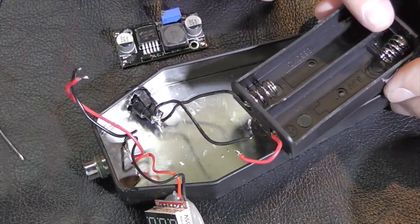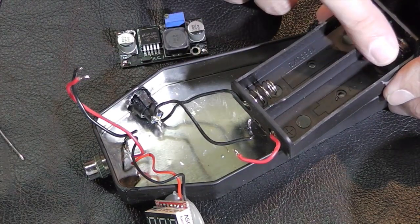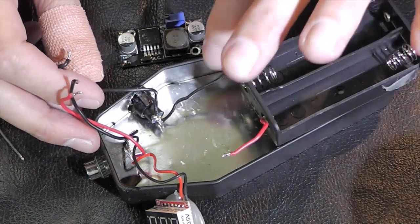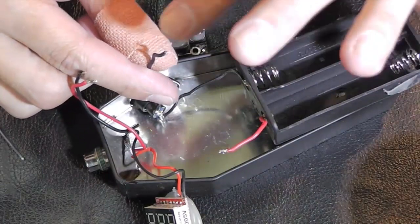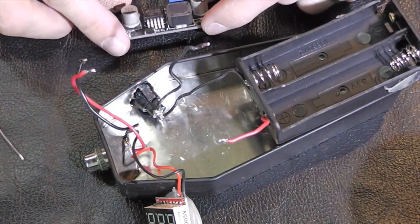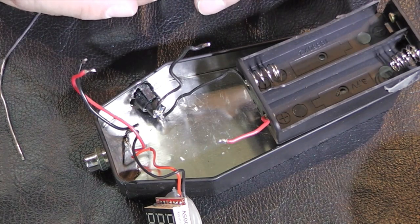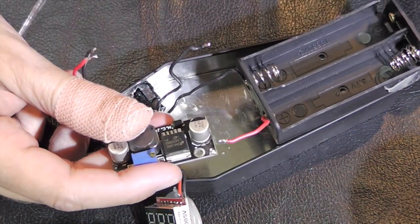Now, this is our battery supply. As I say, I'm going neg to pos, back round to the neg, up to the pos, and I've got two outputs. One here, which is going to the input of the board, one which is running via the switch, which we know is working and we tested, and one back out to the neg. So these two wires need to go on the input of my board. Now, my input of my board is marked up, he says, looking at it. He also needs glasses, I tell you. So my input is marked up relatively simply there and there.